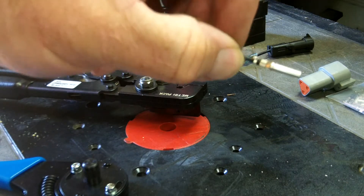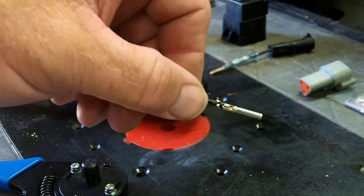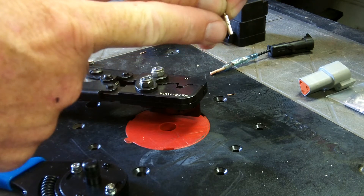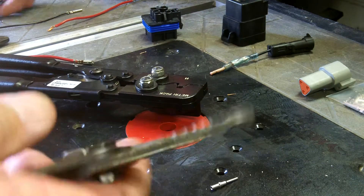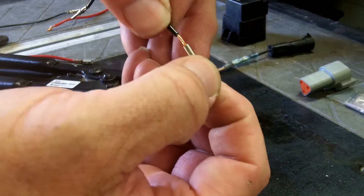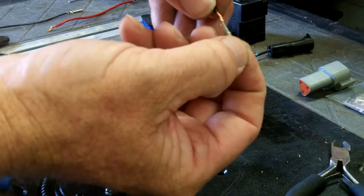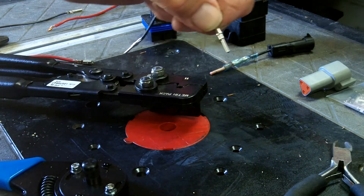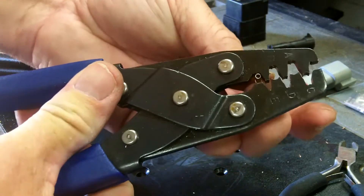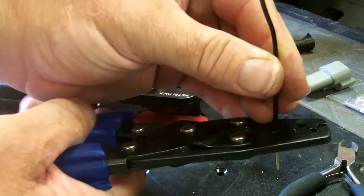Some people want to keep the non-solid barrel type connectors because that's what's already on their boat, but I'm gonna go with solid barrel from here on out. These are super slick — they've got a little hole in there so you can see that the wire is pushed in far enough. Strip the wire, push it in and see how much is hanging out, trim a little bit off, and check it again — complete coverage. You can use these cheap $8 pliers on solid barrel connectors the same way: preload the connector into the pliers, insert your wire, and give them a crimp.